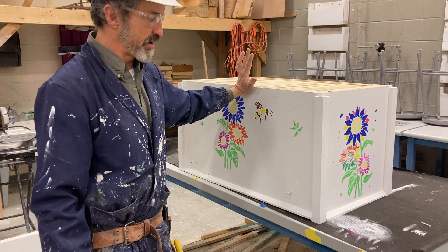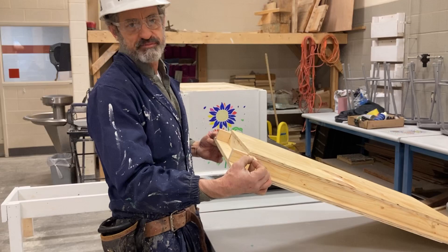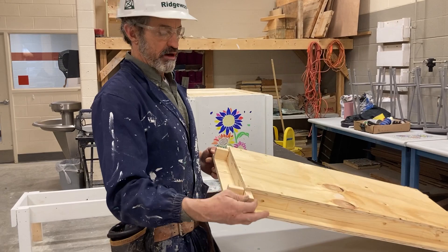I have several of these at my house — they work great. So, this is what the base looks like. The first thing you're going to build is an insulated base. We built our insulated base out of half-inch plywood and three-quarter-inch strips that we made out of scrap 2x4s. We took 2x4 lumber left over from a project and ripped it one and a half inches by three-quarters thick, which is the same as a 1x2.